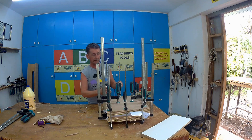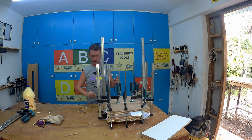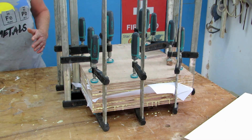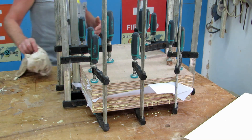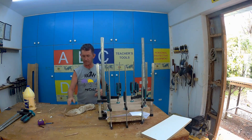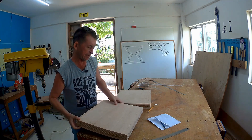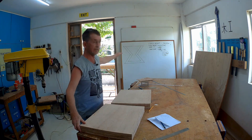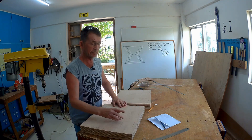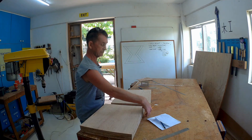I put 12 clamps on - around the edge and big ones going in towards the center. We'll clean off the excess glue. I put it over on its edge and clamped it down to keep them straight. The glue is oozing out everywhere, so we wipe it down - don't use a wet cloth, just a little bit damp. Wet cloth on plywood is not good. These came out fine - they're heavy, but when we cut them down they will be much, much lighter. I'm leaving a piece on the top for fixing. Normally you wouldn't glue a leg to a table - you'd screw it - and we will make up some sort of bracket to go there later.